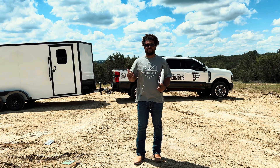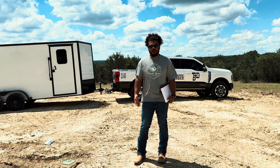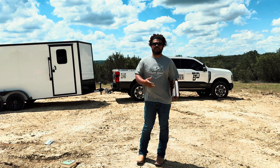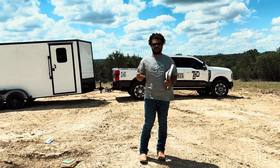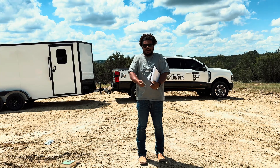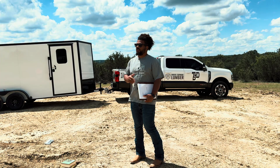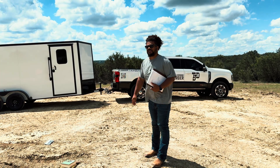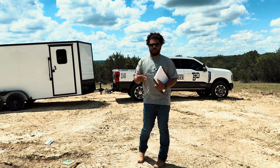If you don't know this clay, although it's pretty much concrete when it's dry, when it gets moist and then dries out it expands and contracts — it swells and then it shrinks. So for a slab foundation, if you keep doing that to a slab, eventually you're going to start getting cracks. When I was looking into what it would take to get this slab poured, I realized this is giving me all the problems I don't want.